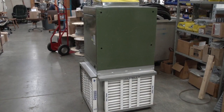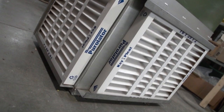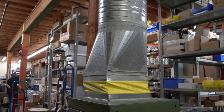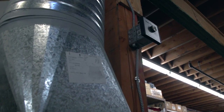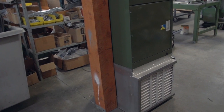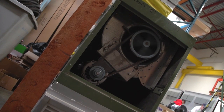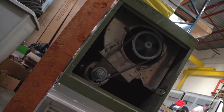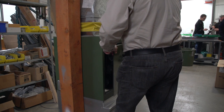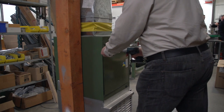In a warehouse, the term that HVAC people would use is stratification layers. Temperature naturally goes to various layers in a room. If a room is 25 feet tall, the lower area will be a colder stratification layer, then it gets warmer, then it gets even warmer. Those layers can act like a cushion. Most warehouses are heated from the ceiling, with a gas heater or a radiant heater, and often people put in rotary fans to try to push the air down, but you're pushing against a layer of cold air at the bottom. So heat rises, it's going to bounce back up.